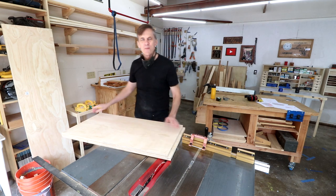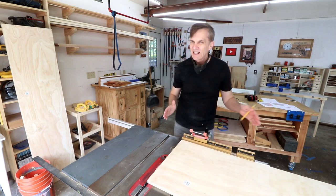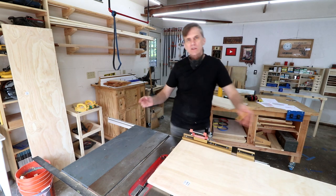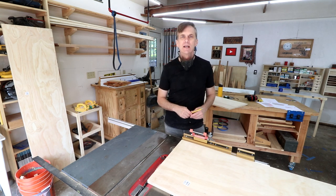I'm also going to mark an X on it so I remember that's my measuring board. The most important thing is to use that one board to measure each additional piece — don't use different boards each time. These cuts probably won't be all exactly the same as they would be with a fence or stop, but they're long boards, so if they're off by a hair it really shouldn't make that big of a difference.